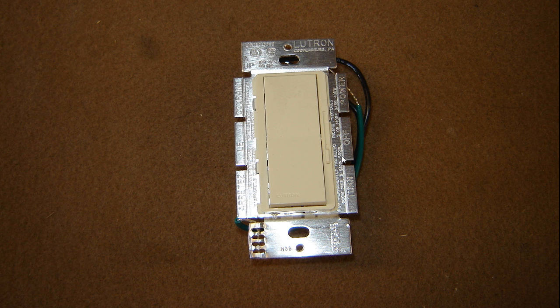One of the things I want to point out that a lot of people don't understand is that you put this in a regular single gang box and it's fine at 600 watts. But when you start ganging these up — putting them in a two or three gang box — and you start breaking these tabs off in order for them to fit in the boxes, it takes away the wattage.